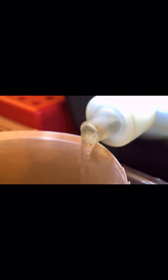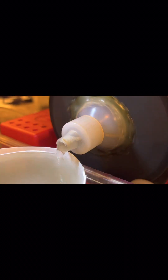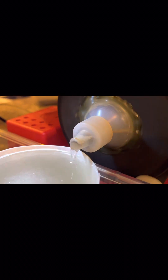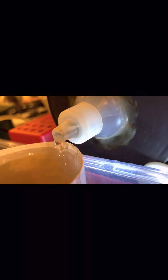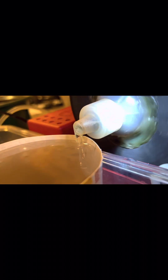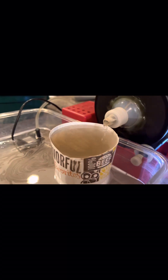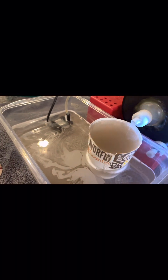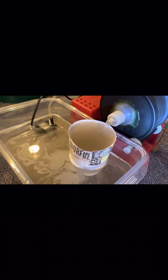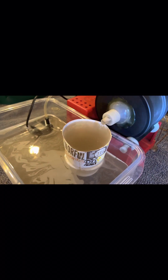After that, the heavy mineral sands will get rejected, and then eventually if you get enough gold built up in there it'll try to start spitting the gold out that nozzle - but that takes many ounces to get to that point. The mercury is just floating around there collecting; it actually tumbles in the very bottom corner the whole time, rolling in a ball in the very bottom corner. It's almost impossible to see. It looks like it needs a few more scoops before it's going to be flat enough to start spitting down some of the heavier mineral sands.